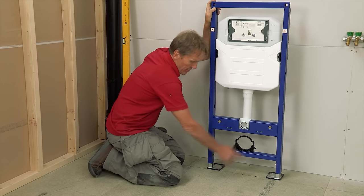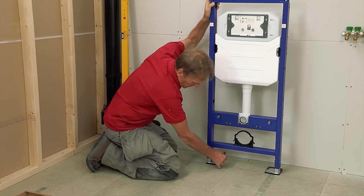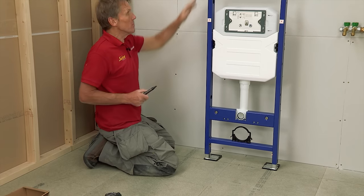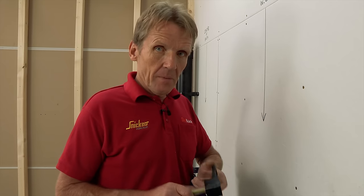I've got a nice parallel line along the front at 225mm, where the front of the wall is going to be, and I can mark the centre so I can assemble the brackets for the top of the frame and fix that.